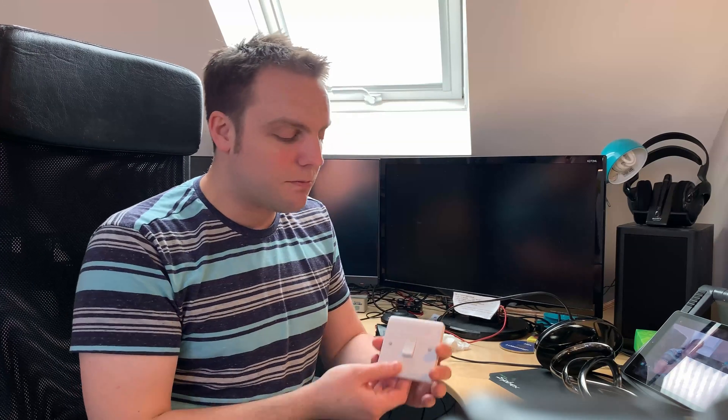But there's no push button interface. If you're working with a KNX system or indeed any other system — and Osram Lightify Pro provides a push button interface — you could mount it behind a switch to just pick up between the common and L1 as you push it and detect that to put the lights on. I'm ultimately using this as a proof of concept for a larger switch. Anyway, let's give it a go.